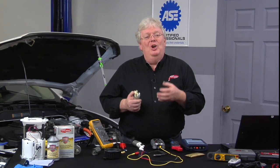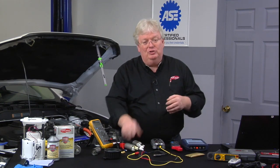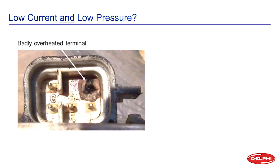How does a toaster work? It's a resistance. What is the voltage drop across the bad terminal connection? Let's say the male terminal is too big for the female terminal — we have heat buildup, and that's what causes that crusty critter we're seeing right there. However, don't stop at your inspection there. Look closer.